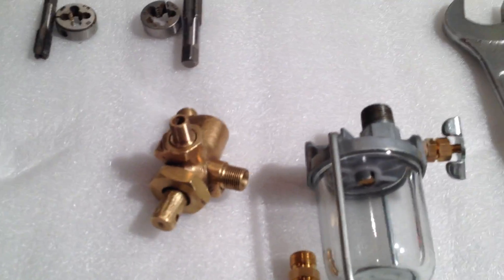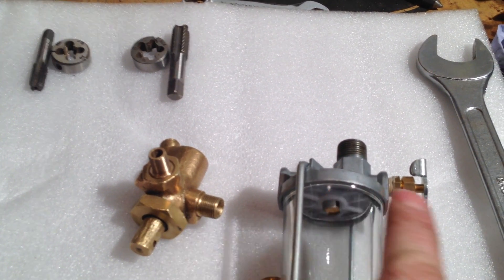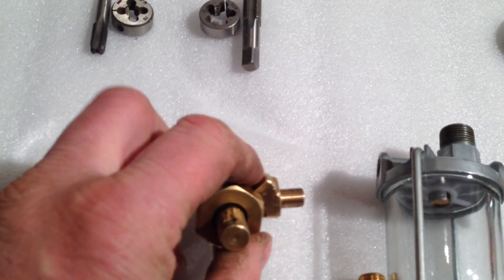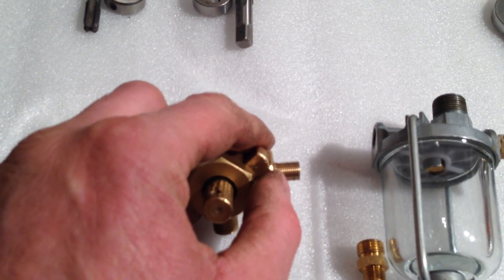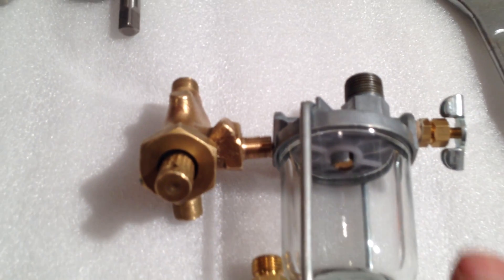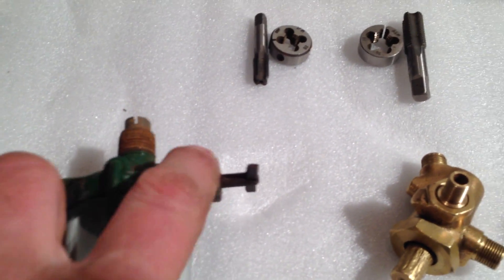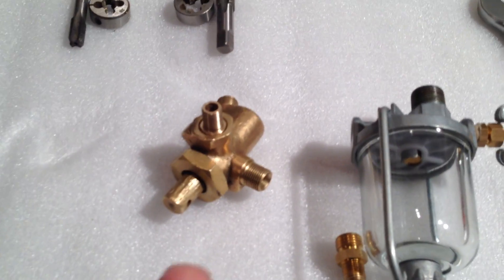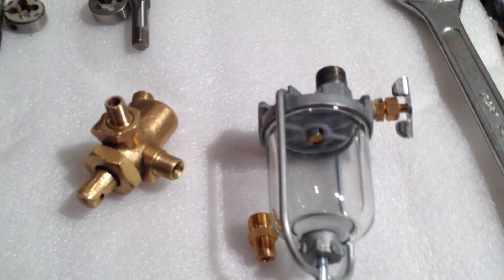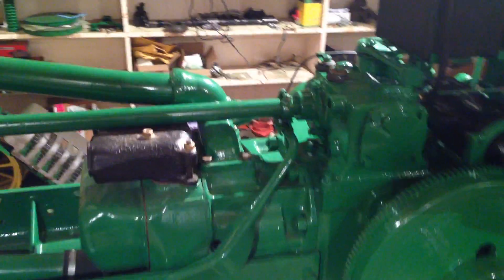I have these on two tractors and you can't tell the difference, but the benefit is you end up with a much better tap for turning the fuel off on the main tank — that's the key benefit. So if you can get somebody to make it or you make it yourself, this stepped little fitting will allow you to use the improved fuel bowl and does away with the poorer tap system on the originals. I know I keep saying I want it original, but at the end of the day there are things you just need to upgrade a bit. There's nothing worse than having fuel dripping on your new paintwork — fuel is the worst killer of paintwork, it really is.